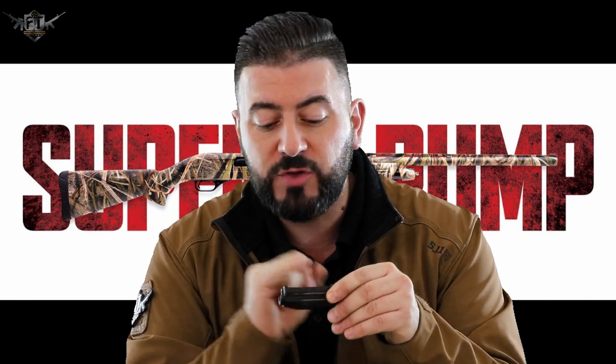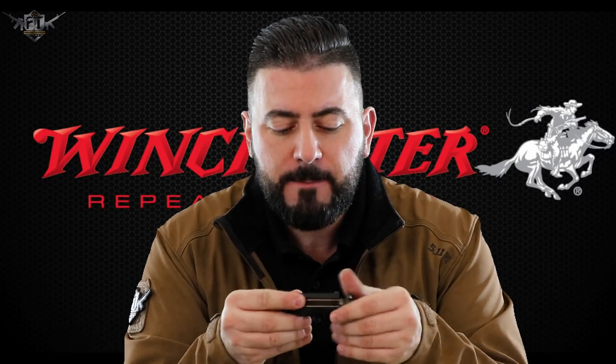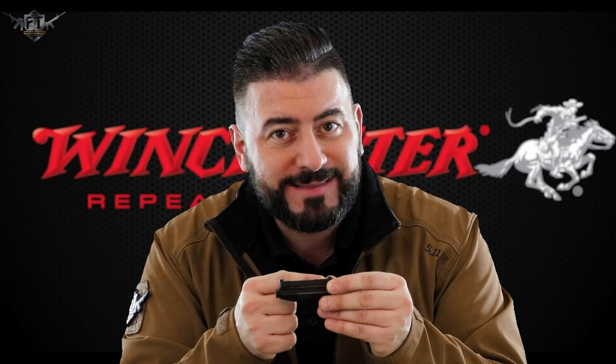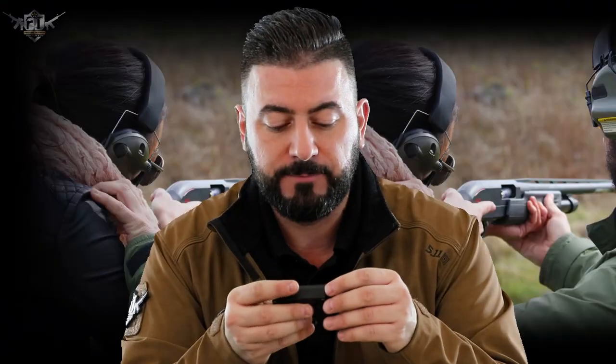You can take the lug out and take the bolt out. All you're going to do is point — sitting through here — get your pliers and pull the lug out the bottom. When you do that, a spring and a washer are going to fly out the back, so hold it down, get your pliers, pull it out. When you put it back together, make sure you line it back up. I've got a scratch on mine straight down the middle showing where it lines up, so when I put it back in it's turned the right way. That way the firing pin will be seated correctly. Also, you've got your ejection pin on the side — make sure that's on the ejection port side when you put it back in.